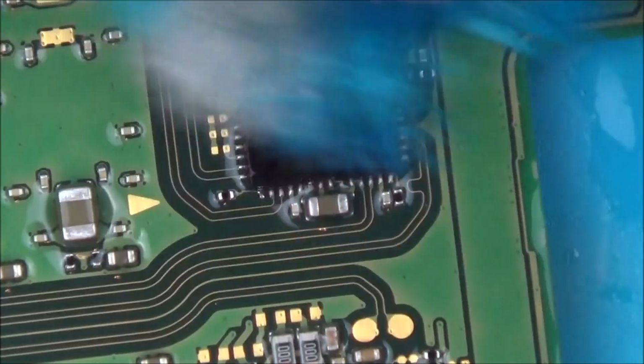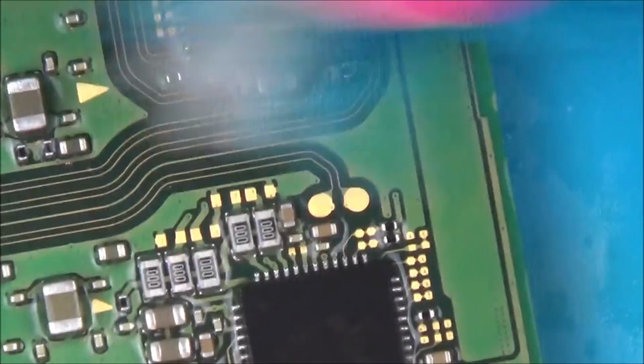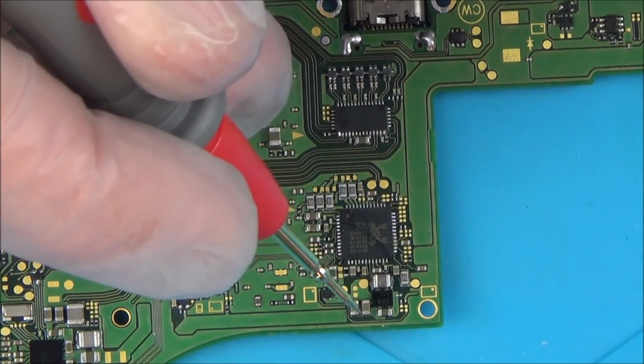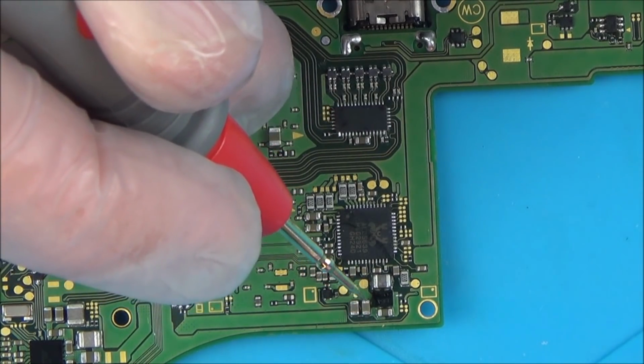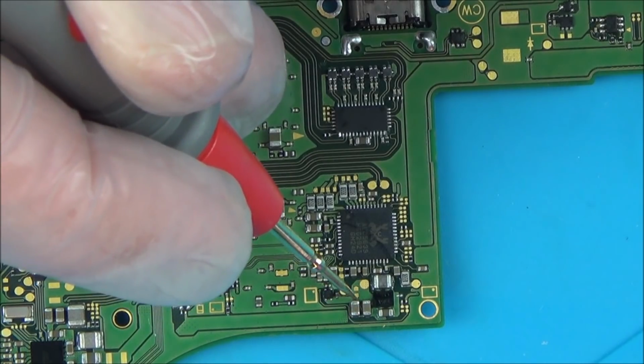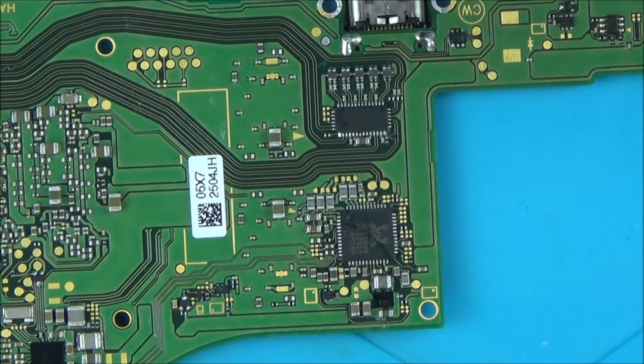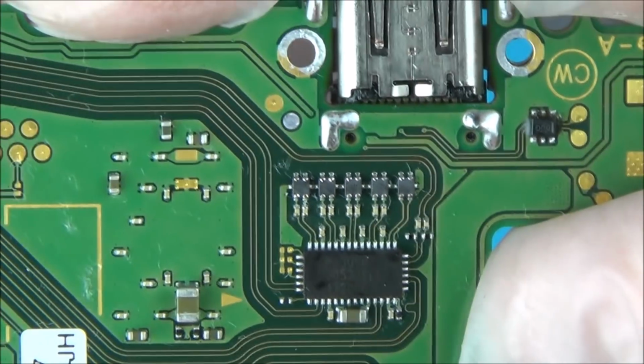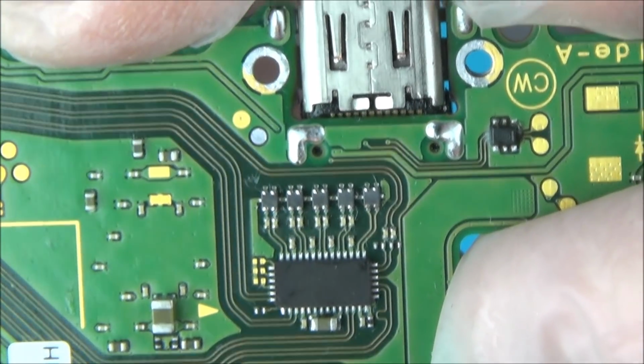Now these chips that I'm putting on, I do not know if they're good or bad. They could be faulty chips. No? Excellent. That's not shorting. Let's go up here. That's not. That's not. Excellent. So something's definitely changed from last time. And if you have a look, I'm pretty confident that that is in the right position. Can you see it looks to be central and nice and straight.